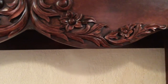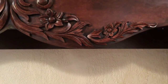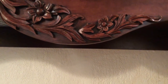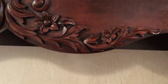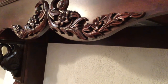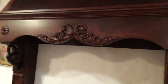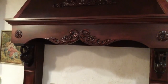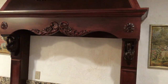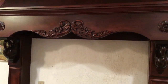If you look at the flower on the right, you'll see past it there's a leaf and then it ends — that was the original first piece, the small one, and then the larger second piece. I cut part of the onlay on a machine and blended it down so it would mix together. In the very center where that highlight shine is showing, that's where I carved it down so it matched the same thickness as the other piece of the onlay. I blended the two pieces together so it looks like one swag in that large curve. That was important for craftsmanship — those little details are what make the piece more professional. If you just take an onlay and stick it on, it's not going to follow the curve. I wanted it to be framed out and a little more decorative, but I also wanted it to be a centerpiece without being overly done.